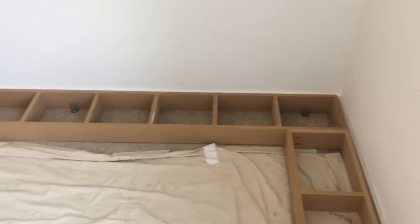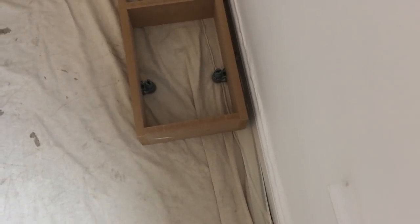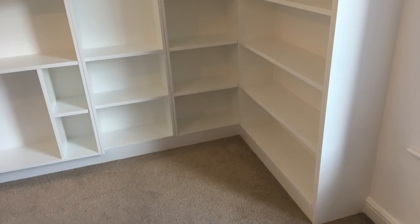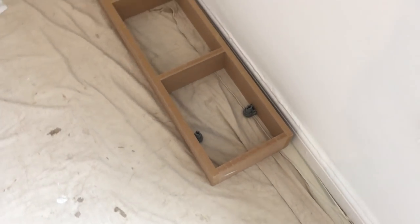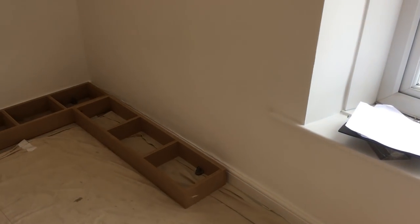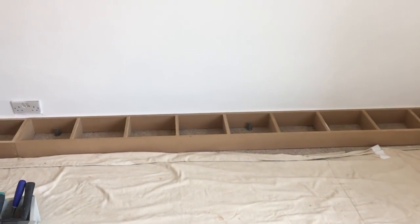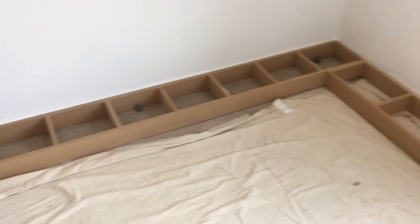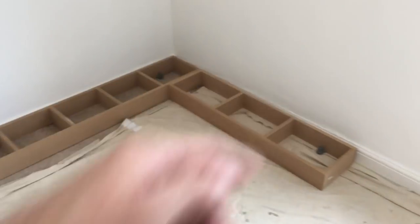What this enables me to see is, for example, the wall here is not square — it's at a bit of an obtuse angle. So I can immediately see that the cover panel which will come up the side of the unit here will be a bit deeper than planned. We leave a 20mm scribing allowance on panels like that, which should be enough, but to check it I can offer up a level from the back of that unit, knowing where it's going to land, and then possibly change the positioning of these plinths — bringing them a little bit tilted to reduce the gap over there.